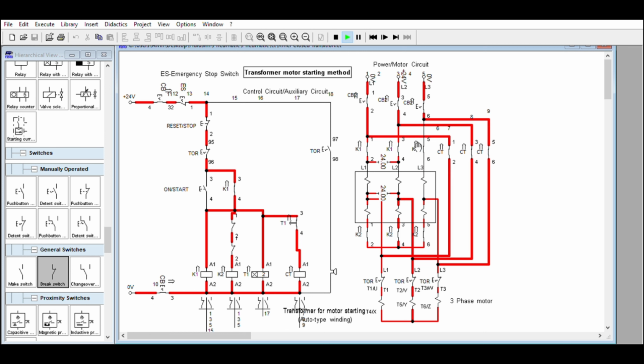Okay, here are the 3 contactors in operation. This is 24 volts. If this were in reality, this one will burn this winding. This one will burn this winding. They are short circuited there, because we tied this to it. So we have to open this one to free up this winding, so the whole winding will be open circuited.